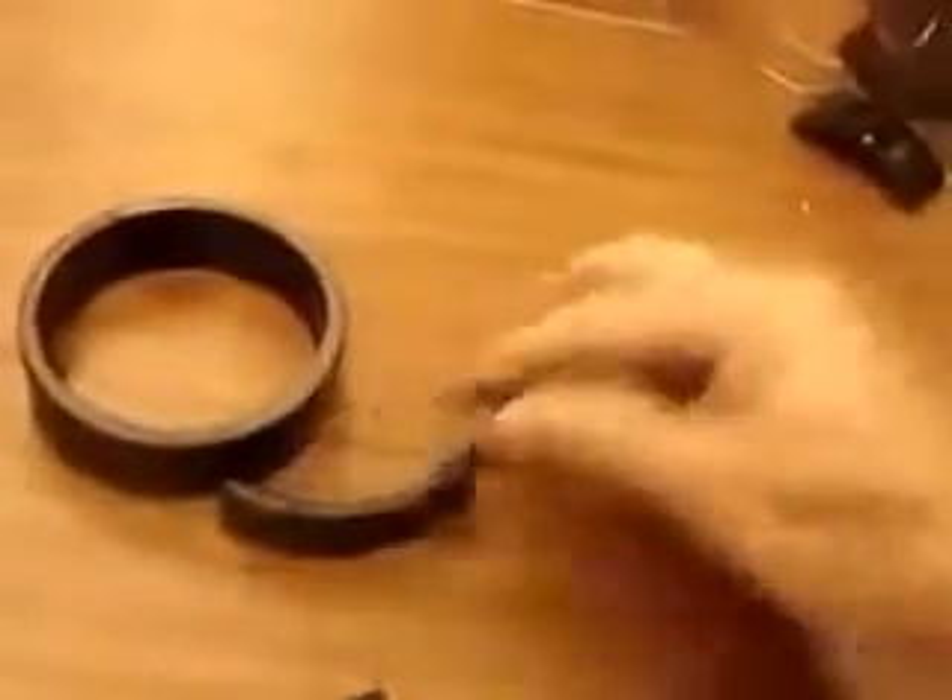On this one I've put little spacers between the magnets, and I've got it well centered so it spins very nicely. I used little plastic spacers — little pieces of cut plexiglass. If you want to get fancy, cutting rings of black ABS sewer pipe or plexiglass gives you something much classier. Here's the upgraded version of the generator.